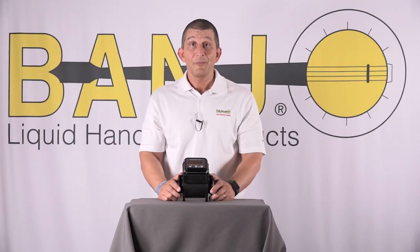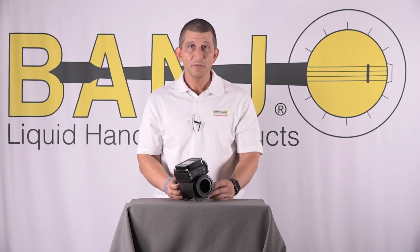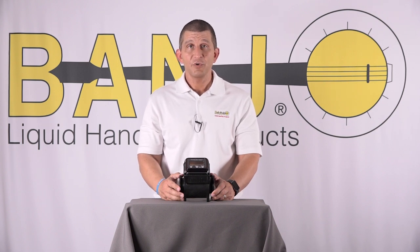This is an electromagnetic flow meter, which means your liquid must be conductive. How it works is it shoots an electrical current from one probe to the other. This means your conductivity rating of your liquid has to be greater than 20 micro Siemens.